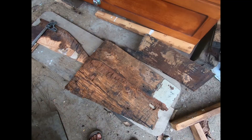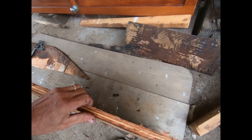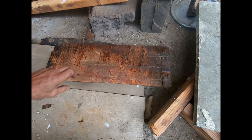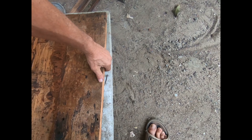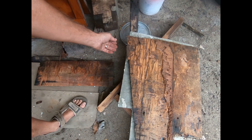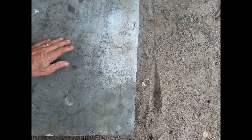The old floor is three quarters of an inch — 20 millimeters thick. This is another little piece of subflooring. Holy smokes — it's a little short here, but I think I can live with that and just make it up with fiberglass because it'll all get fiberglassed over anyway. This can be sanded down, make it look good, clean up all this putty somebody's been mixing on here, and that'll be a nice subfloor.